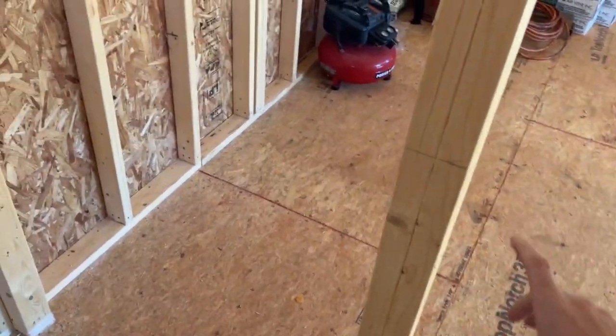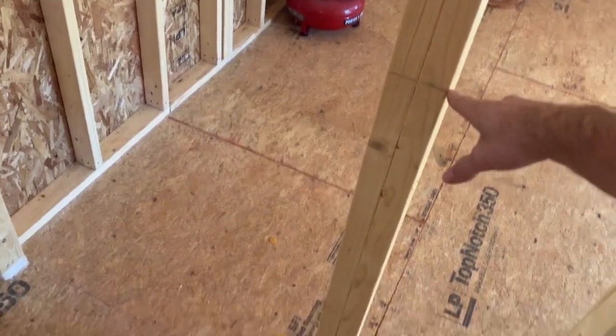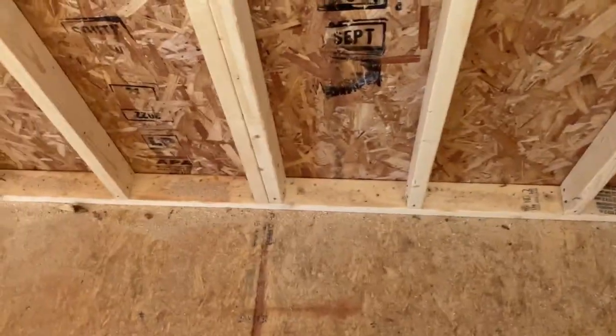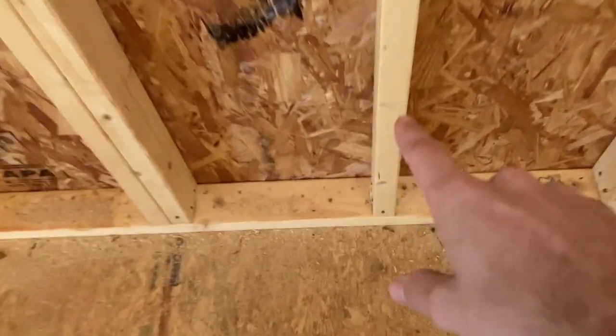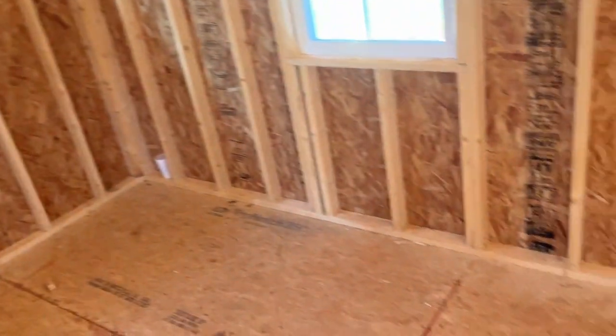We use the blue nail-up boxes that you nail to the side of the stud, and the tops of the boxes are 48 inches from the floor on switches. Outlet boxes are 16 inches from the floor to the top of the box. I've got about 2 to the wall. I think the code, around here you don't have inspection, but we still try to do everything to code.